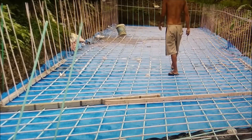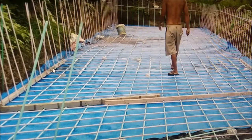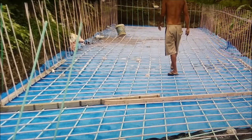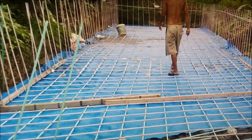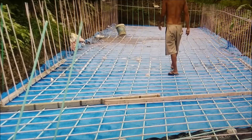Sometimes you use what we call dog bones — a rubber bar that's got a thin middle and wider edges, with a cross-sectional area about like a dog bone. You pour your wet cement, do your first screed or first float, then you put this rubber down in there. That encapsulates the bottom into the floor, and when you pour your wall it gets it on the top, so it makes a reasonably watertight seal. I haven't bothered to look for that in the Philippines — it just seems like something you wouldn't be able to find here. So we decided we're going to do slip forms, and these bars will be right down the center of the wall, all even, and the wall will be very well anchored to the floor.